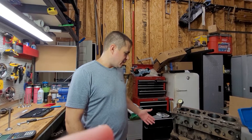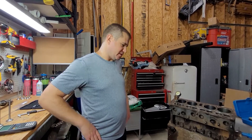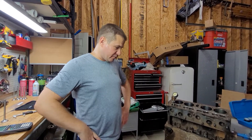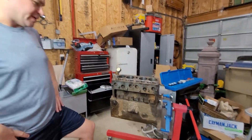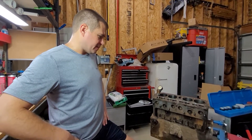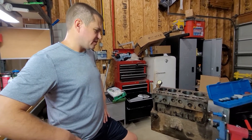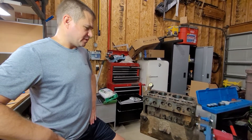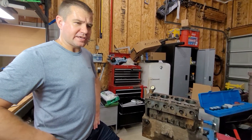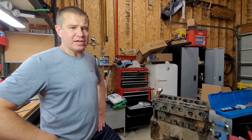I'm going to go ahead and measure the rest of these off camera. The next step after we get all this measured and valve geometry put to bed is installing the cam bearing — I'll film that for you guys. Unfortunately I didn't film the removal of the cam bearing, but I can show you how to do it during installation since it's really about the same process. At least the number one exhaust valve is concentric, and I think we'll get similar results on the rest. In the next video we're putting in the cam bearing and hopefully the camshaft, tappets, valves, and all that. Thanks guys!